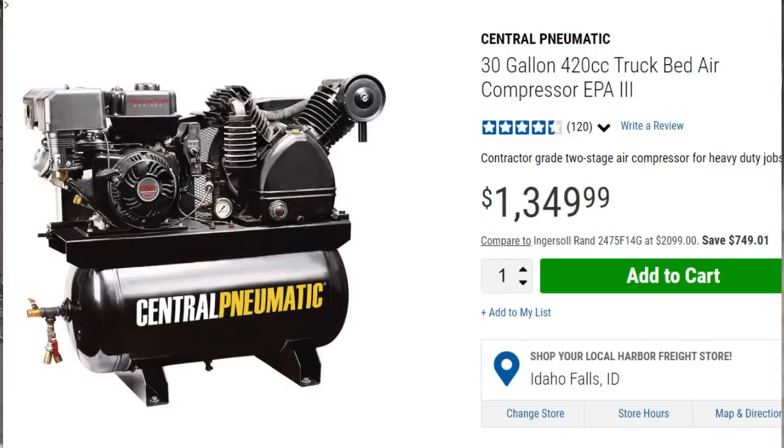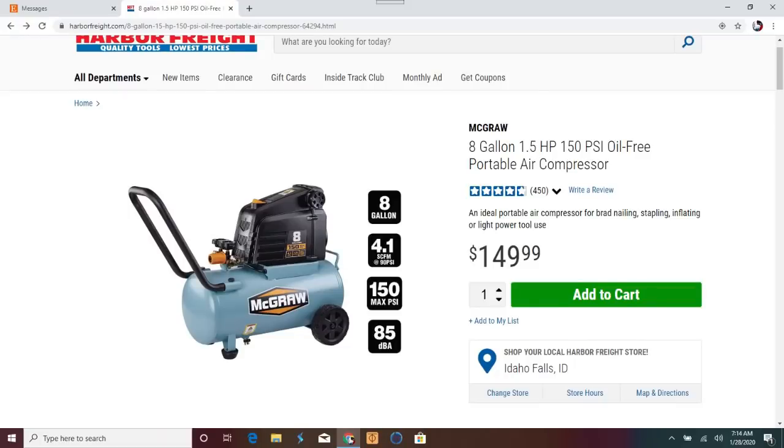And on top of that, you need an air compressor that's a minimum 7 CFM if it has a big compression tank. And if it doesn't, it needs between a 12 and a 19 CFM compressor. Huge. And it just would not work. We had to abandon it and do it mostly by hand because it just would not work with the air compressor that we had. There are other stucco applicators out there that you can get. They just take huge compressors to operate them. And this is going to be such a time saver. I'm really excited about it.